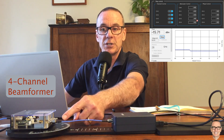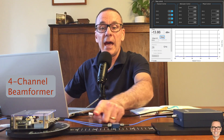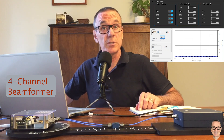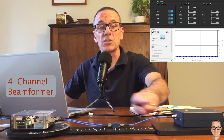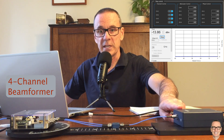Let's think about phase calibration now. To do that, we'll introduce a coupler that couples the output from two of the ports and then look at the relative phase — doing this for each pair of ports. With two cables connected via the coupler, the received signal is minus 13.86, which is stronger because they're being added together. But we need to check whether that's the strongest it can be — if the two signals are not in phase, we won't be receiving the maximum possible.